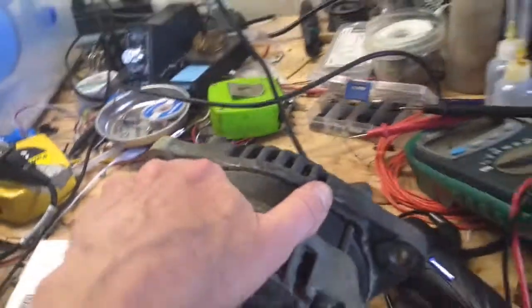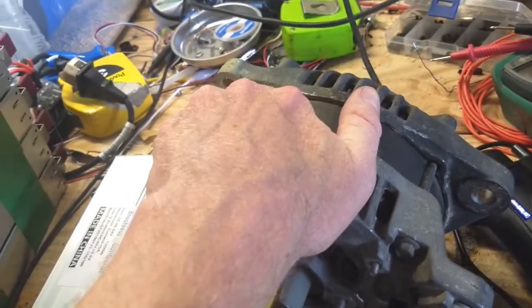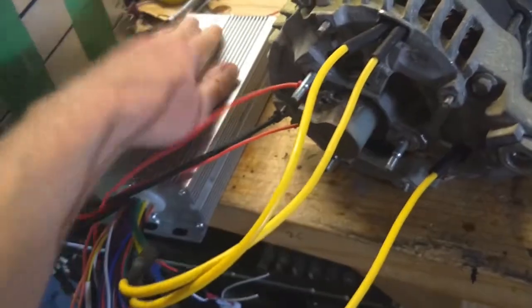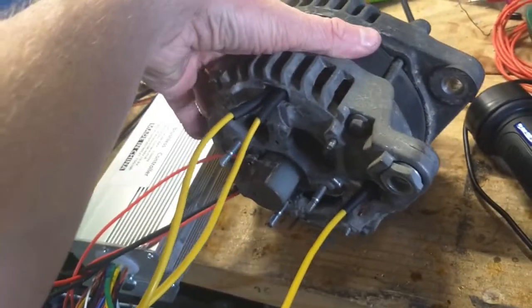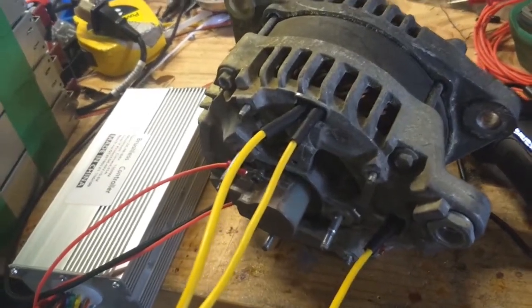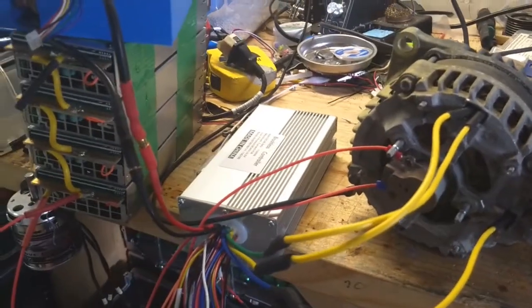I was thinking about doing field weakening, but seeing how fast that spins... right now this has already gotten pretty warm just running it up and down. Wires are not warm at all, speed controller is not warm at all, but the housing and the stator have gotten pretty warm. Not sure why — 45 amps for this motor shouldn't be much, but it should also be able to cool itself. So yeah, it works.